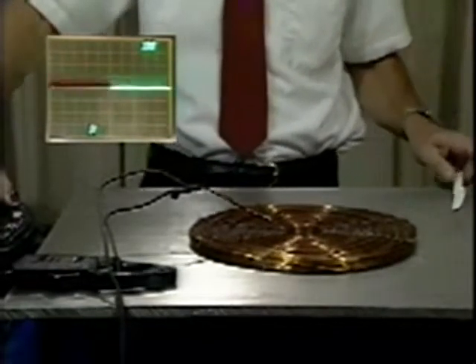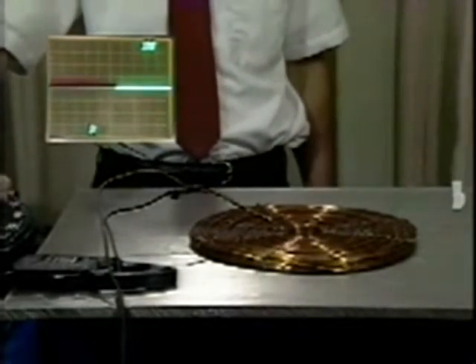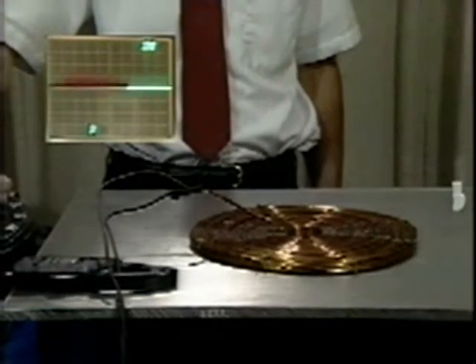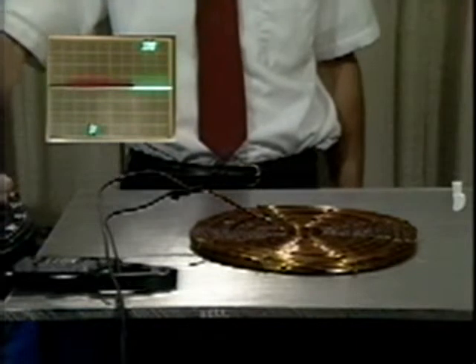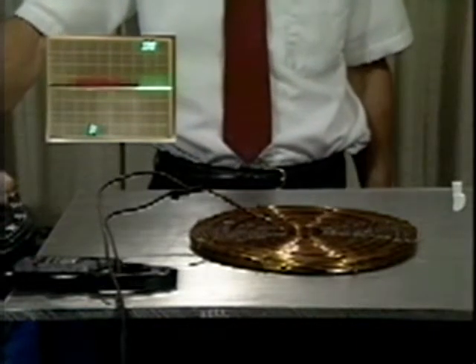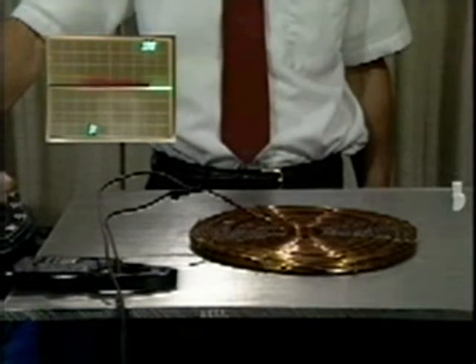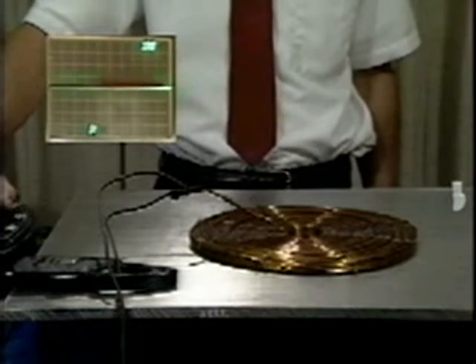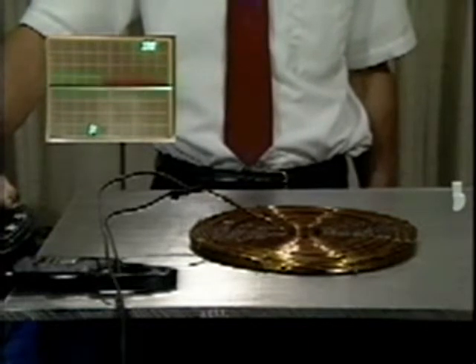A typical current in the coil is 20 to 30 amperes, so it's made of large-diameter wire to reduce its resistance. The 250 turns are of number 10 aluminum wire. Aluminum is chosen for its light weight — its density is 2.7 grams per cubic centimeter — so that for a given current and thus magnetic force, the coil will rise higher than if made of copper.